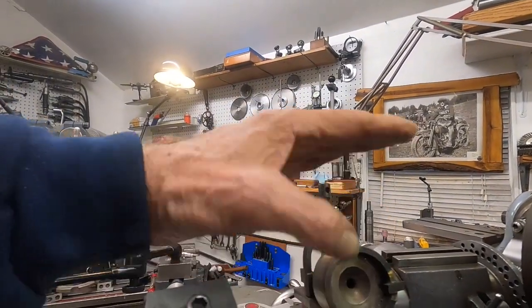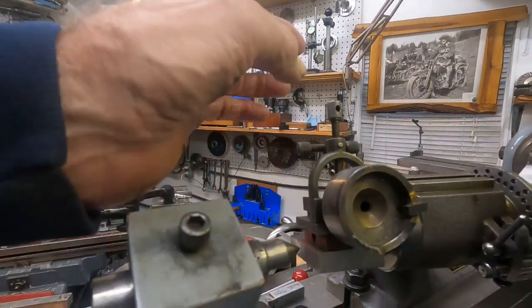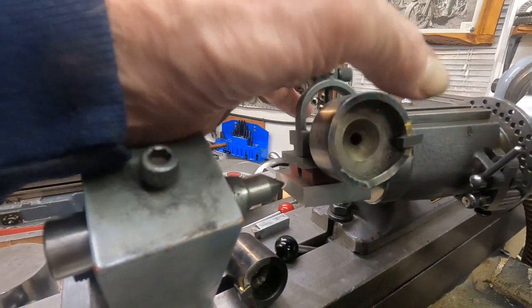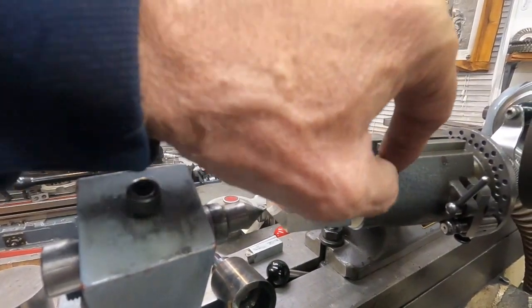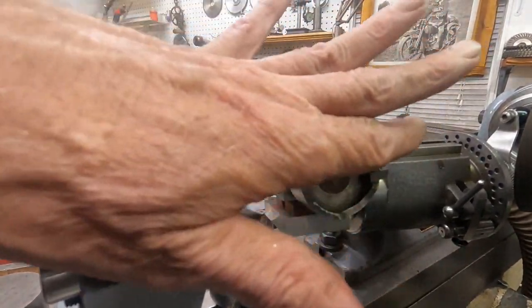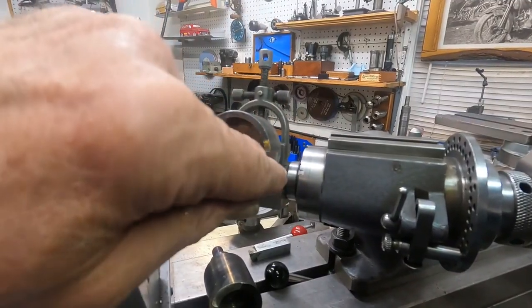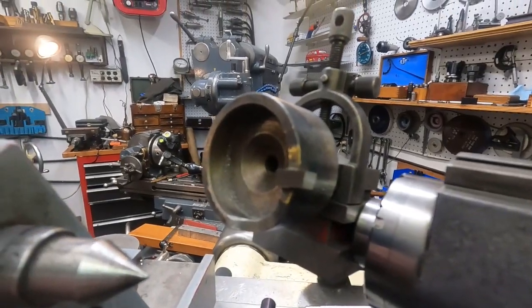When the cutter is rotated to center, it has some rake here. I suggest playing around with this on a drafting table or just on paper with a compass and a ruler. You can see how easy it is to set angles by lowering a notch and then rotating it to center — it gives you that automatic back rake. Then you can add some side top rake if you want, by angling the notch that the carbide is brazed into.